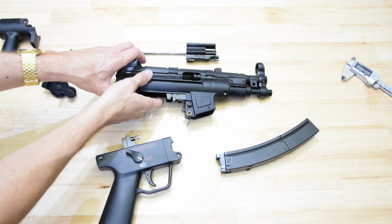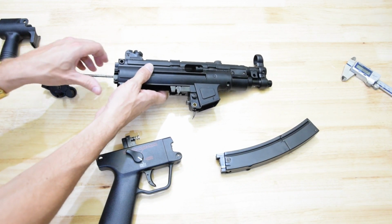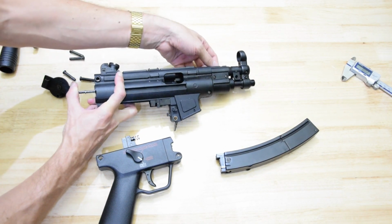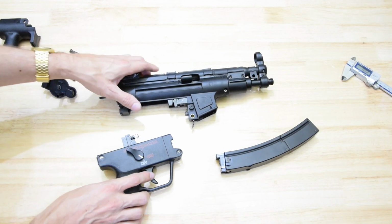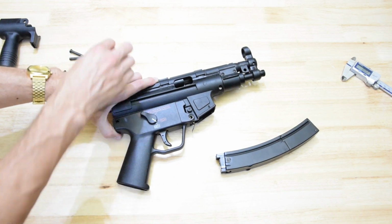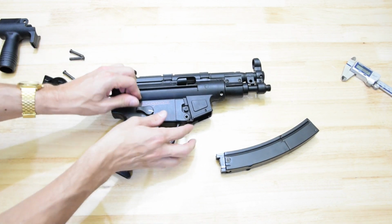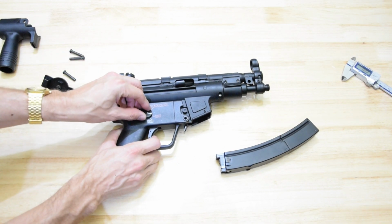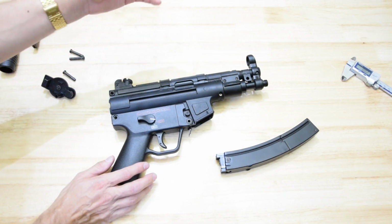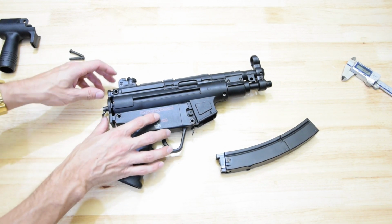Alright, I quite like this. I like how this goes in. Ah, okay, I see what they've done there. So you want to have a pin through there, and you want to have safety released so that you can release the sear so that you can then slide your bolt back in, because otherwise it would have been cocked.